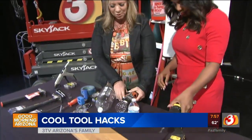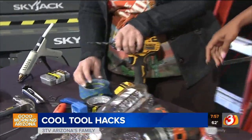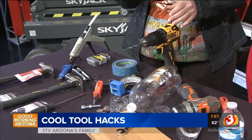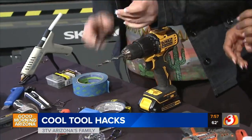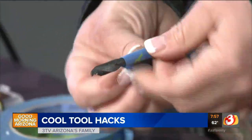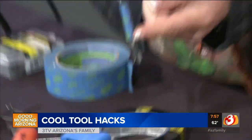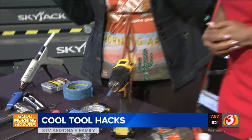And here's a quick one: if you only want to drill to a certain depth and you're worried about going too far, just put tape exactly where you want it on the drill bit — measure down and put your tape there. When you're drilling in, you'll only go that far, so you know exactly how deep to go. At 9:20, we'll have even more fun hints and tips to get you through your projects.